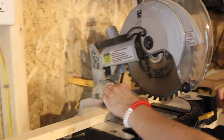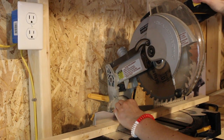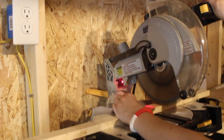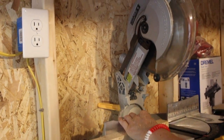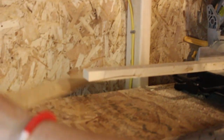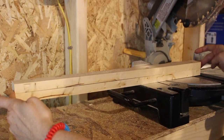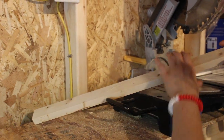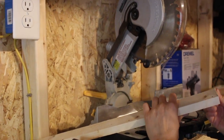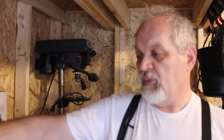What we're doing is using the existing cut piece to make sure all of the other pieces are the same size. The reason we do that is because even if our first piece is a little bit wrong in dimension, consistency is more important. By following the same piece it will always be consistent. That is more important than being the exact length. So we're going to cut at least four of those — actually more — using the same process.